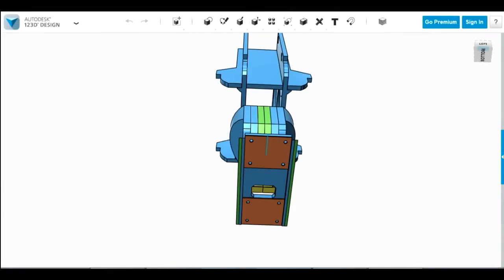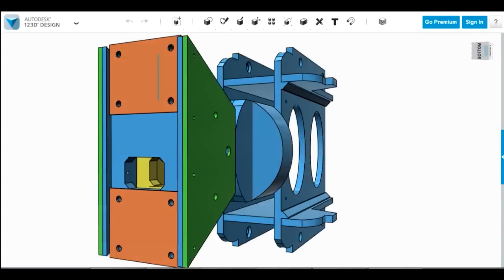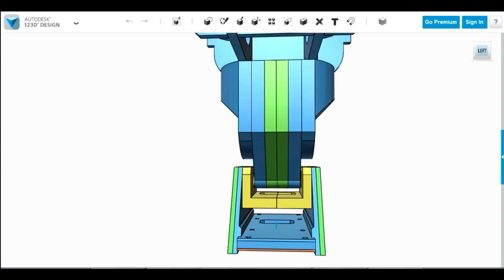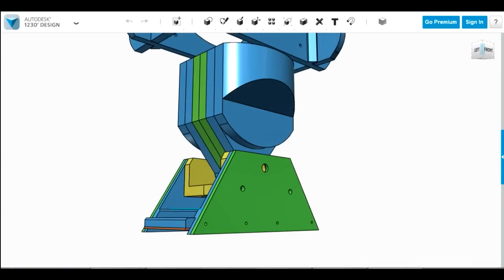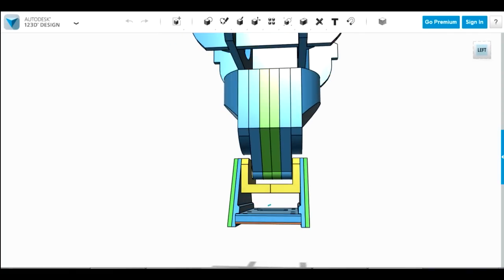So the red plate's on the bottom here where the casters screw on. And effectively it's a fairly standard centre foot and leg. Now I've made the joint quite a lot wider, about twice as wide as it should be. Normally the centre foot has a joint or leg piece in the middle that's about an inch wide, and one of the main breakdowns with R2s is the centre foot hinge breaking, and that's because as the droid turns, of course, you get a lot of sideways force on that hinge when it's driving in three leg mode, because the front leg is sticking out of the front. So I've deliberately deviated from the design and made this whole joint quite a bit wider.